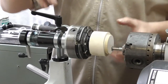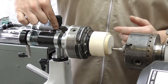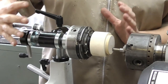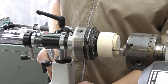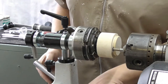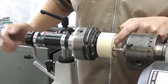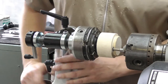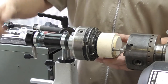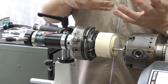I've mounted the cutter up and put the chuck onto the threading jig. Make sure you've got your finger gap here and again about 10mm gap on that part, then we're going to take it up to the cutter. What I actually do is rest it on the part there and pivot until I see that it's parallel — you might mark the wood but that's the bit you're going to cut into so it doesn't really matter. We're in there and parallel, so lock everything down. Then fire that up and do the kiss test, then count off the clicks.